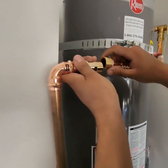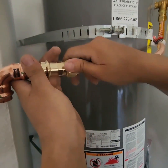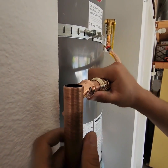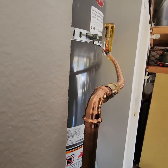There's a new method of connecting copper pipe that plumbers everywhere love — it's called Pro Press. You can see it right here. This is called Pro Press: you don't need to solder, you don't need to heat anything up, melt any solder, or get anything dirty. You see that fitting? It pops right over the pipe.